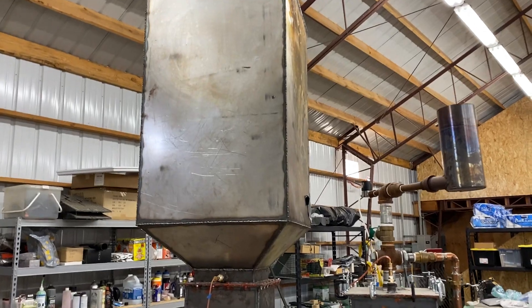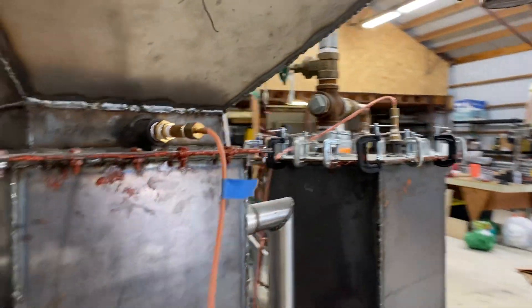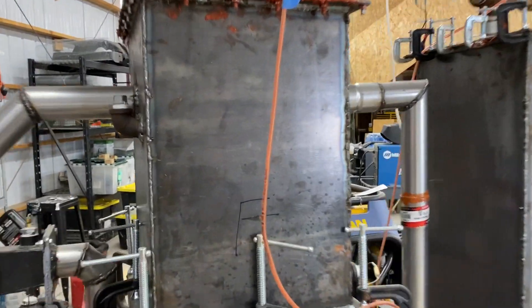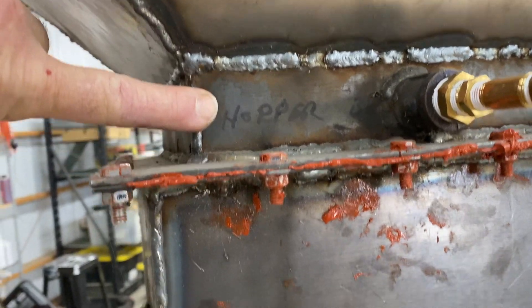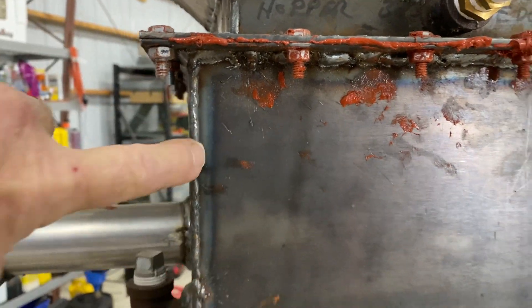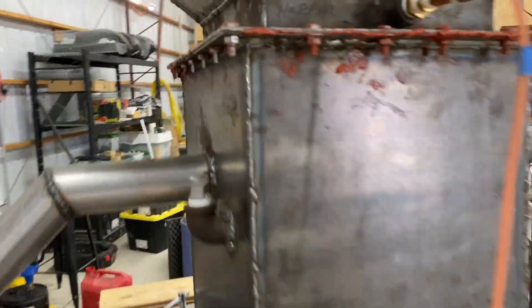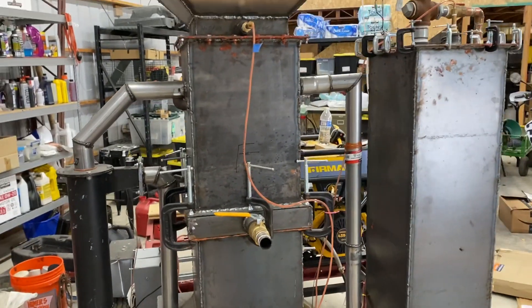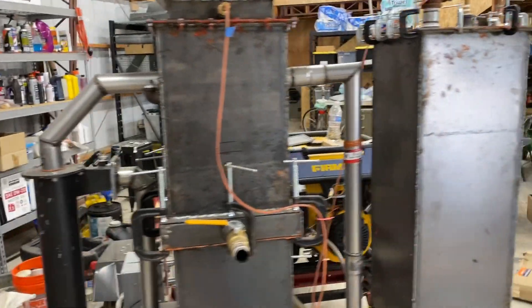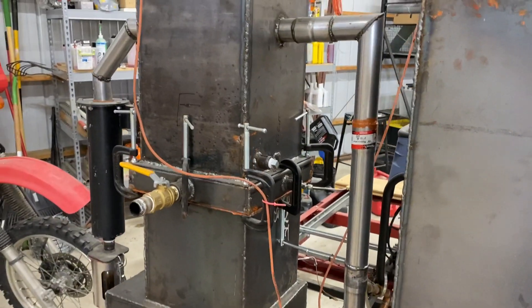The hopper — biomass hopper. This is what I call the top pressure port. The next stage is the preheater. There's an inside and outside layer, as you can see — that would be the inside diameter, a space, and then that's the outside. So you've got an inch jacket around the preheater here, so I can dump solvents in here to leach out and then drain it down. So as this jacket becomes congested, there's a mechanism for cleaning it out. Ideally I'd put a jar or something off here to catch some of the liquids as they're generated.